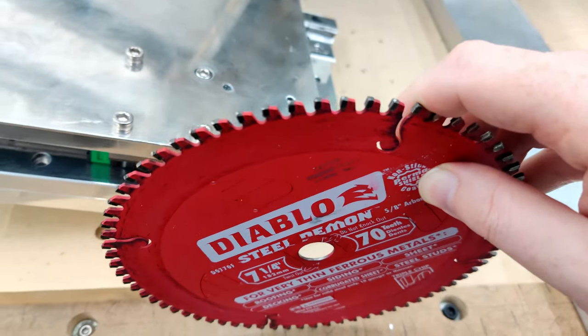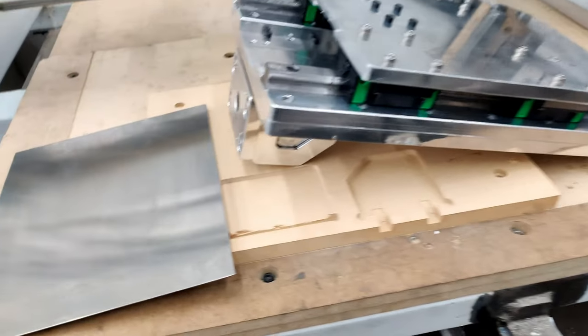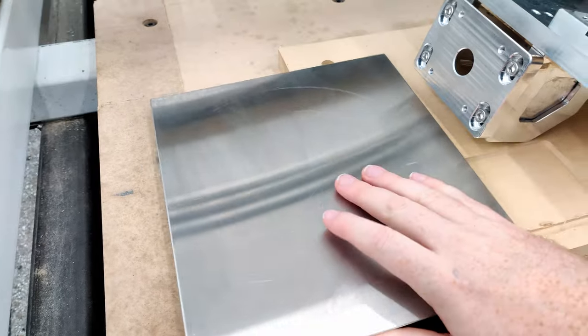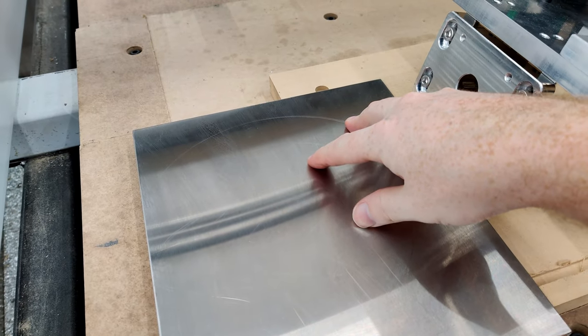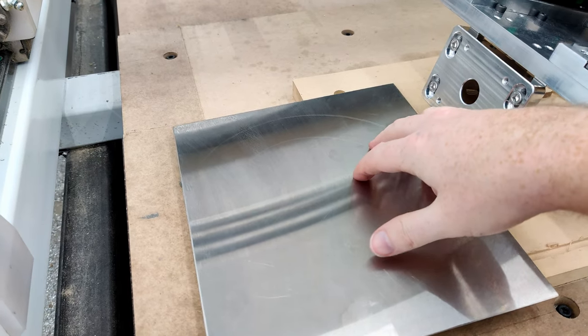So rough cut the stainless steel to the rough size, and then what I'll do is the hold down method of using tape, and I'm going to continue using epoxy because I have that, but you could use super glue. Stick it onto a spoil board of some sort, and then I'll just mill out the profile of the thing and all the holes. What do I got here?